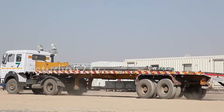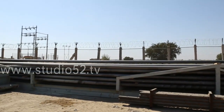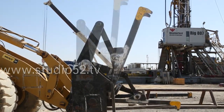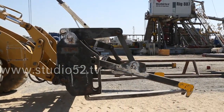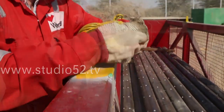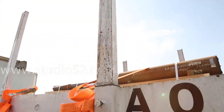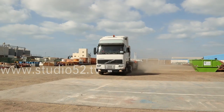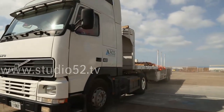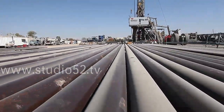Tubulars are delivered in many combinations, from single to bundle packs, or are loaded into pipe bins, so the lifting method changes. Depending on the job, tubulars may be uplifted with a pipe clamp attached to a forklift, with slings and choke hitch methods, or by attaching slings and shackles to attachment points on pipe bins. All vehicles transporting tubulars must have side stops fitted to the trailer to ensure that no casing or tubulars can roll or fall from the trailer. Most safety considerations that apply broadly to securing loads for transport also apply to securing tubular material.